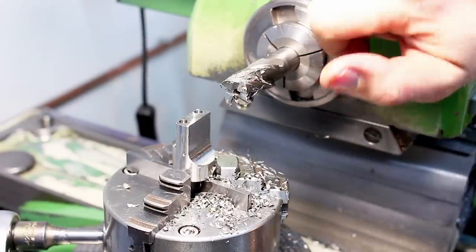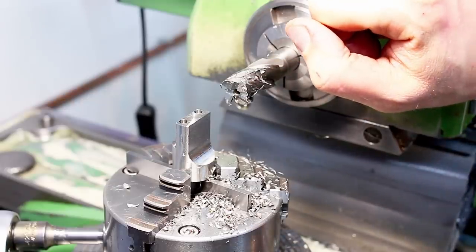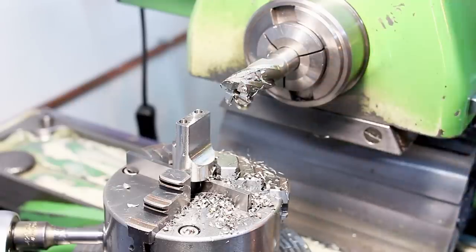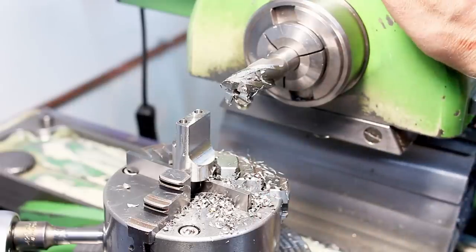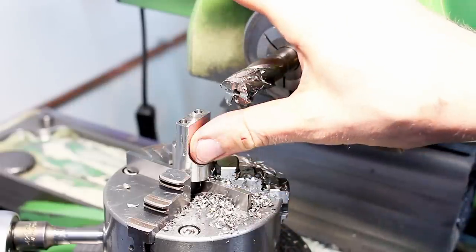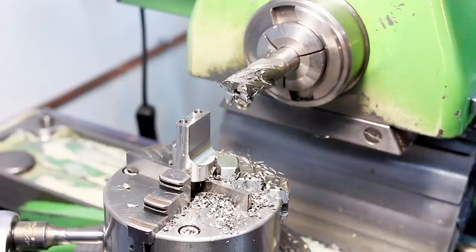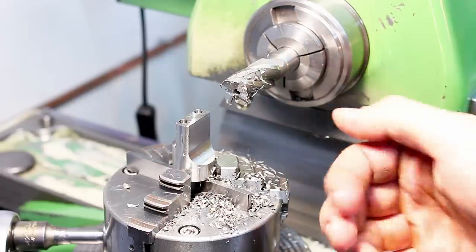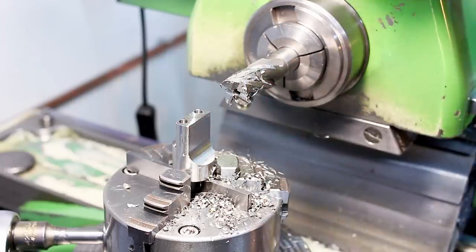Working in this fashion has two advantages. First, we have the increased stiffness of the horizontal spindle because we don't have to deal with the vertical spindle that's cantilevering out far more. But also, we can do this fairly heavy cut as a climb cut. We're dropping the table down and the cutter is walking this way, so it's a climb cut.